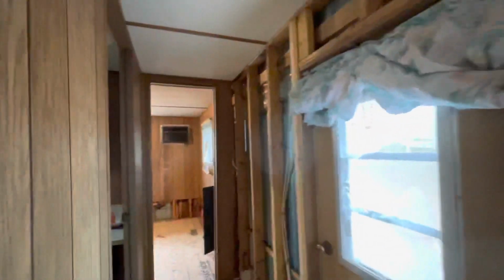I do like the metal gussets. And they did run 1x4s all the way down through here so that their wire could go under it, obviously. But we always got to be careful when we run ours that we don't run a screw. I could easily be putting a screw right there, and I'll screw right into the rafter if I do. So I have to raise this whole roof 1.5 inches up and put my OSB down to it.